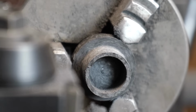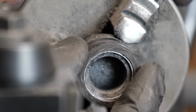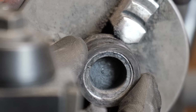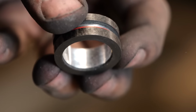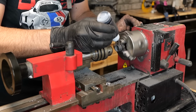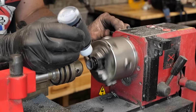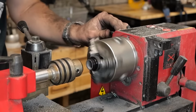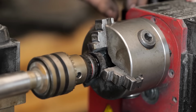All right, here we go. Here is the liner roughly dimensioned out. You can see the whole outer assembly sleeves over that just perfectly. Now we aren't press fitting the liner in place. We did that on the accents because they're so small and delicate, but for the liner we have enough surface area to work with that the adhesive is actually going to do a perfectly good job. And then we should be ready to go ahead and conjoin these all together and move on to the final shaping, polishing, and just assembly of everything.